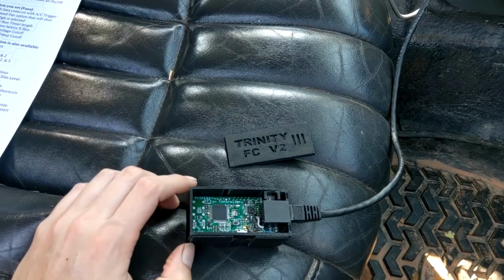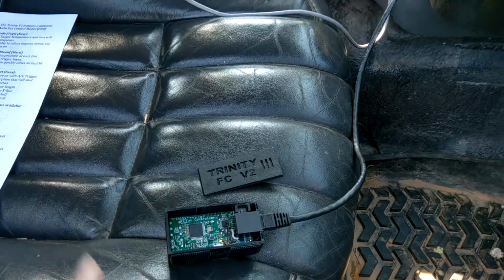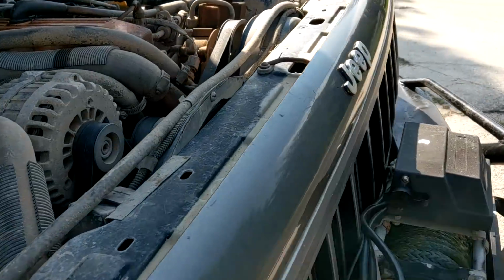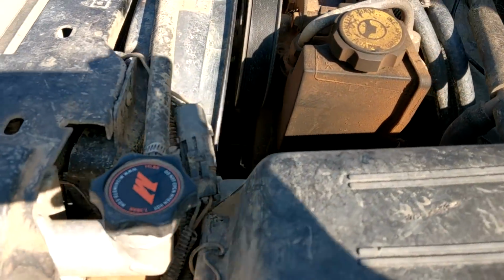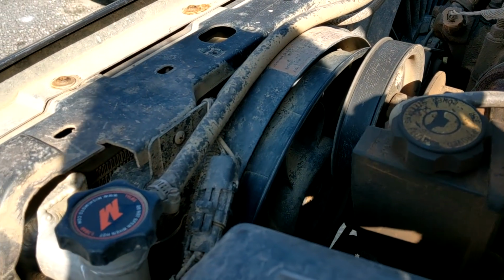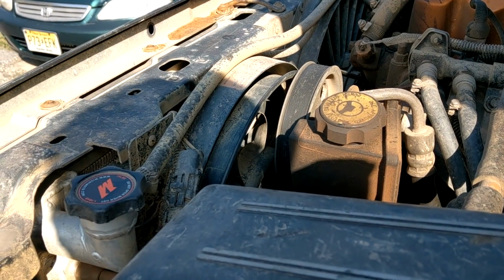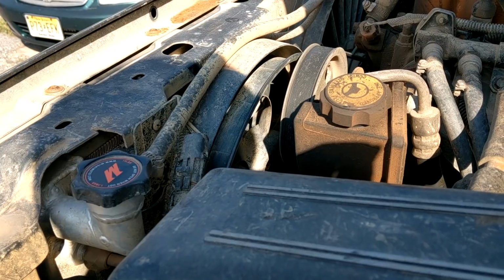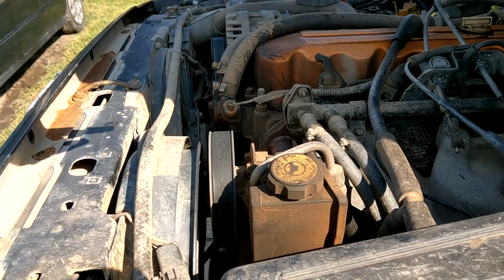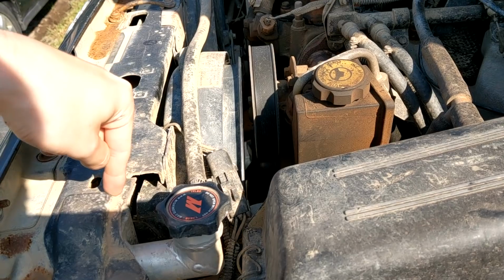Besides that, there's a couple other things I could add, like temperature delay prediction and things like that, depending on where you put the probe. I guess we'll go over that real quick. Where the temperature probe sits is very important. For me, you'll notice that I have mine on the cold side of the radiator, right downstream of the fans. That's there for a reason. You want this to be as close to the output of the fan as possible, so that you have the fastest response time. Remember, the coolant is cycling through the entire system. The fans are cooling it, and then we read what the cold temperature is.